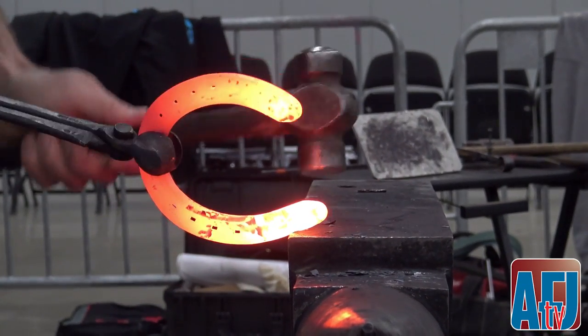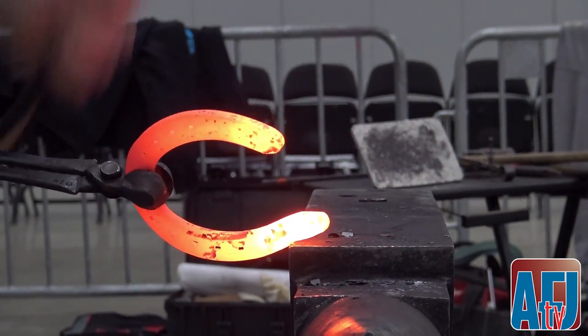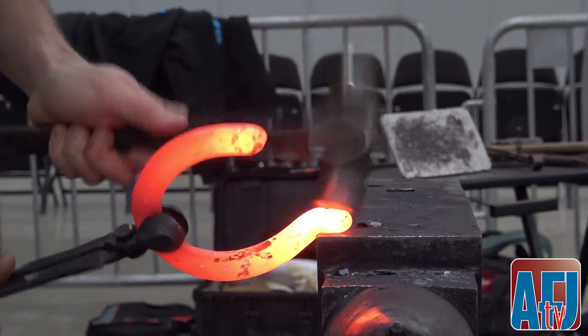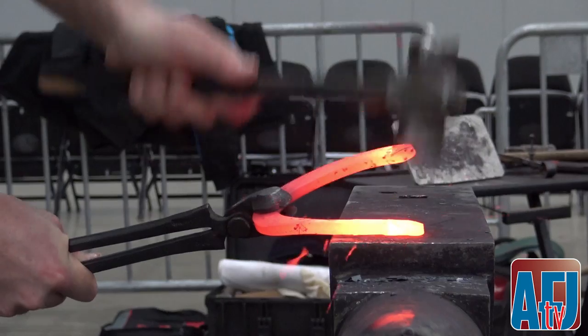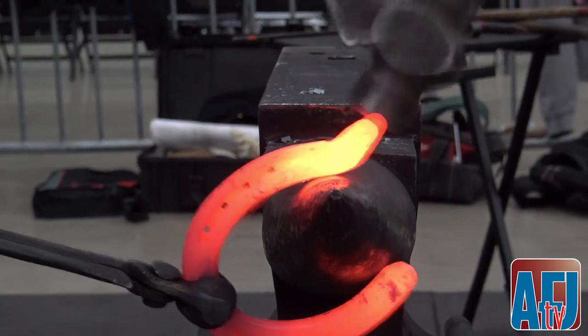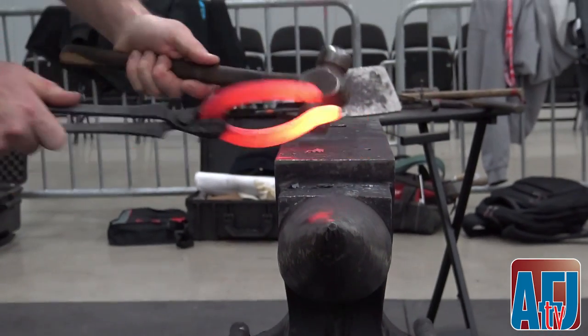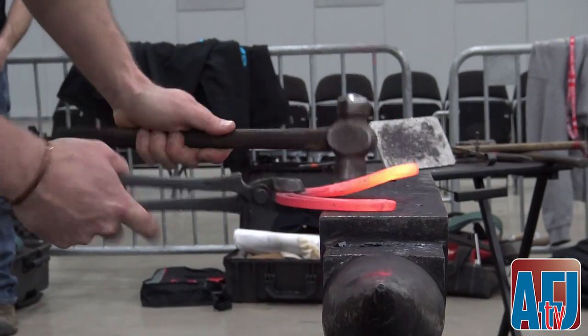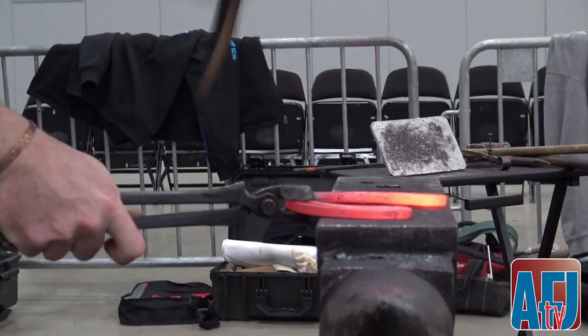The trailer should extend laterally from the centerline of the foot and is longer than the medial heel. Trailer length equals shoe stock width measured from the terminal bearing point of the template pattern. The trailer maintains stock dimensions, is flat with the ground bearing surface of the hoof and the rest of the shoe, and is appropriately boxed.